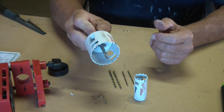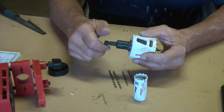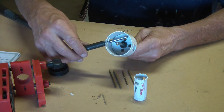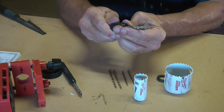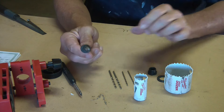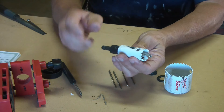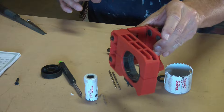Now you drill that out first. Sometimes because of the torque, it will get tight and you won't be able to unlock it. What I will do is take an adjustable wrench, put it on the end here, and use a screwdriver in here to twist it and break it loose to take it off. Once you take this off, you're going to take the spacer and the adapter — you may again have to get an adjustable wrench to break this loose. To cross bore — to drill a hole for the striker — simply insert the arbor and screw it in. You don't need an adapter for that. Screw that in and you're ready to use. Again, put the adjustable wrench here and a screwdriver in here to break it loose because it will be snug.